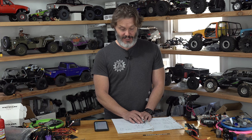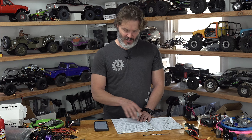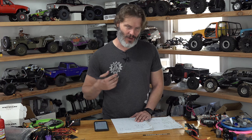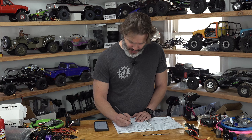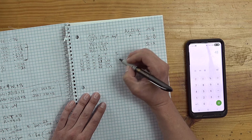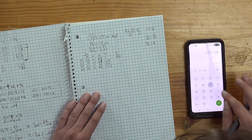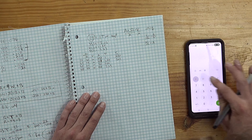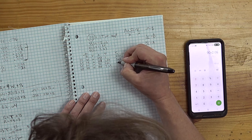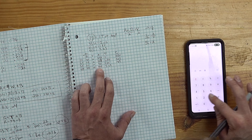I need to do some more investigation to figure that out. Essentially, we have two formulas. The resistance is equal to the turn count resistance plus the brush resistance. And if we go to another turn count that's twice the turns, I know that the resistance is four times that — so the resistance equals four times the resistance of the first one plus the brush. Depending on which motors I was comparing, that gave me somewhere between 16 and 22 milliohms for the brush part, with the remaining being the armature. This is essentially finding two linear equations and where they cross. If I did four equations all at the same time, they didn't actually cross at the same space, so I'll have to do some more investigation. Maybe for another video.